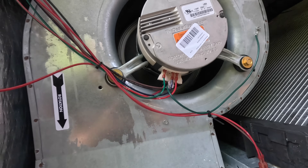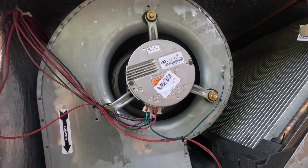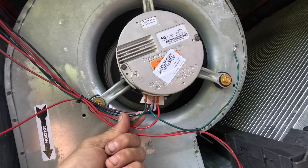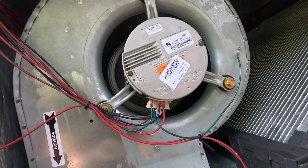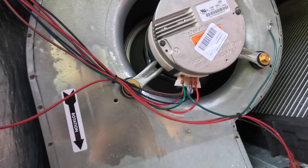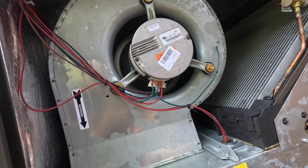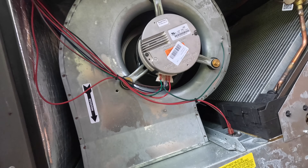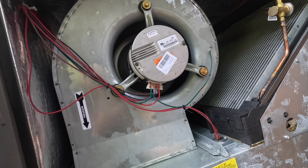Let's see what these red and blue wires are. One of these is going to be for heat — I think it's the red — and the blue is going to be for cooling, if you get a cooling-only signal. Let's put everything back together, turn the thing on, and see if we get decent pressures. The filter inside was clean.